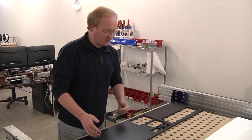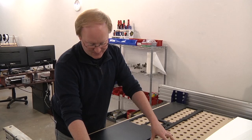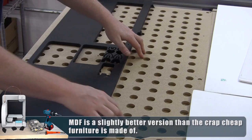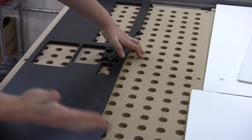I'm going to start routing the parts for the Apple One laptop. We moved the CNC machine, obviously, but when we redid the table, we gave it a vacuum table. There's three total layers of MDF, medium density fiberboard, and the lower two layers have chambers in them, basically chambers for air. And then all these holes line up with it. This top piece is basically a sacrificial piece. There's no screws in it, so we can replane it without hitting any screws. And the thing that's good about the vacuum table is you don't have to use screws or clamps.